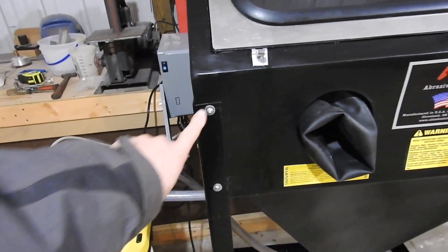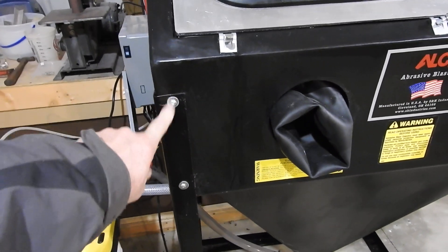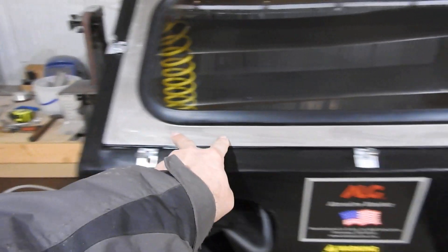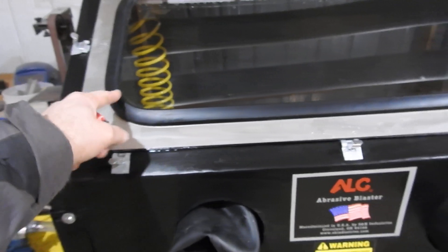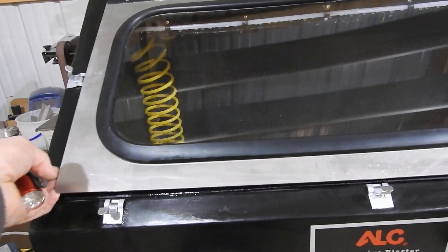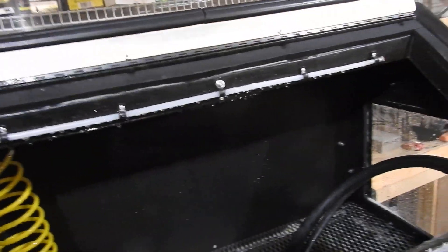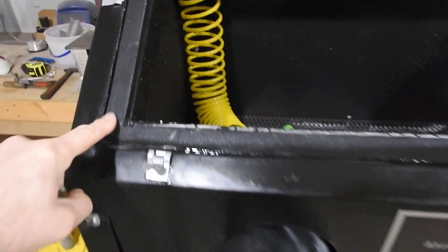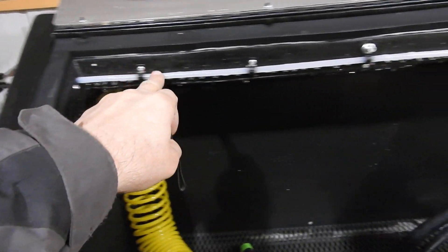I did some modifications to it. I put in all stainless hardware and put O-rings on the inside to seal the holes. This cover was literally just a piece of Lexan, and I cut it out of an eighth-inch piece of aluminum, bought some molding for it, and cut the Lexan down and made the window out of it. So that hinges up, and you've got the five latches around the perimeter that holds it down, and then you've got the foam padding here that seals it.